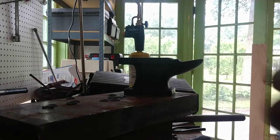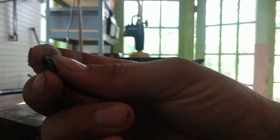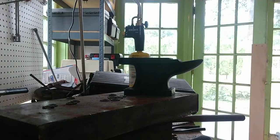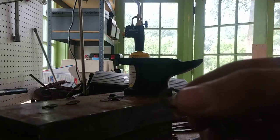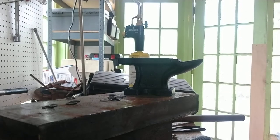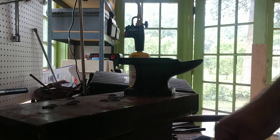Part of what I do with my mail is I cut the rings with the overlapped section beveled, which produces a more historical ring shape. Here is a mass-produced ring, and you can see that the overlapped section is pretty much square. The hole is quite large and completely circular — it was done with either a 1/16th drill bit or a Whitney punch.